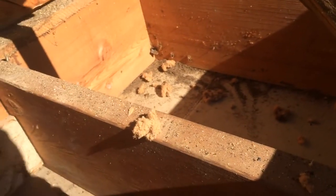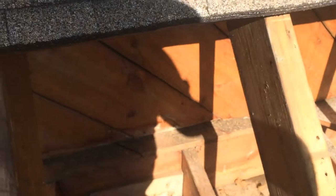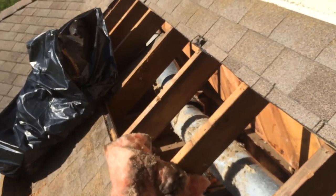Down here you can see where the first round of foam stopped. We foamed that corner shut, and today we're going to foam that wall and then the ceiling. This will all be sealed up really nicely, and hopefully we'll knock a good thousand points off the blower door, because this house is still really, really leaky — and hopefully this will help. So we'll see you in the next one.